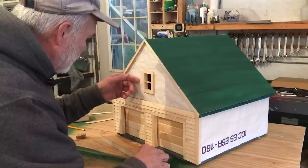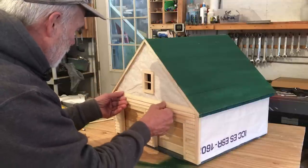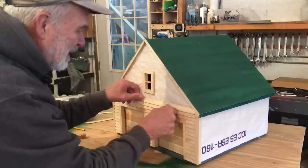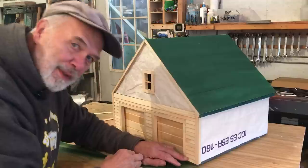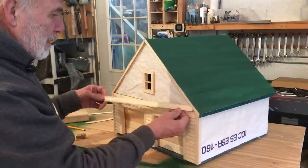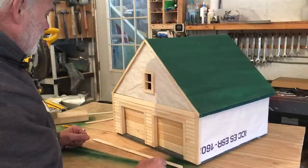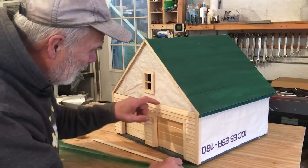The sheathing behind the clapboards is flush all the way down. And when we put this one on, let's see, how can I pick this up? Pick that up. Well, anyway, there has to be some sort of a small starter piece like I'd used down on the bottom here. So I'm going to make a small one there, attach that. There'll probably have to be just a slight, like a 16th or a 32nd leeway so that this will sit down and fit well and look nice. So the first thing will be to make just a little piece here.